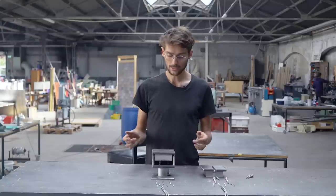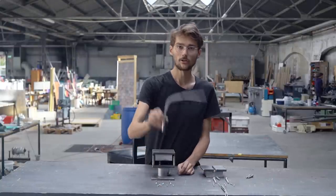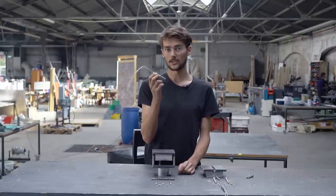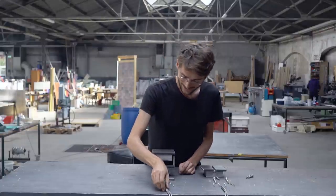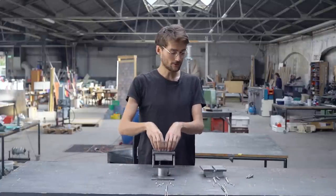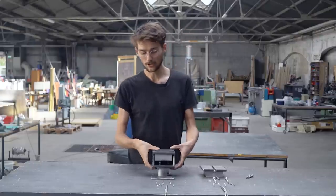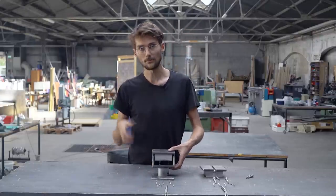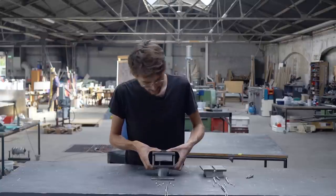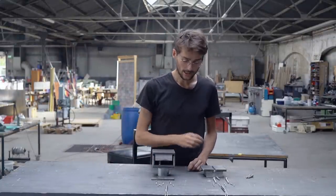They basically work the same. They are two aluminium blocks that we will drill a hole into and stick the cartridge heater inside. And then they are both covered with these steel plates that we cut before so that the steel plates can transfer the pressure into the frame or into the box, into this metal box. And they are both insulated by air.